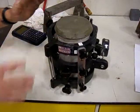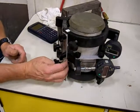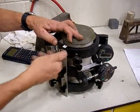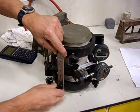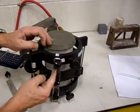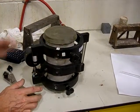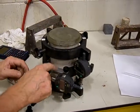That holds this to the sample. Once you've done that, you have to take these aluminum bars off, because what they do is hold this thing together so you can put it on. But they've got to be off or else it's not going to work. So once you've got it tightened up to the sample, you can take these off. You'll see these are marked because they're supposed to go in one particular position. There are those two vertical ones which would prevent these guys moving, and then there's also one in the middle ring, so you've got to take that one off as well.